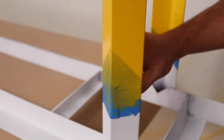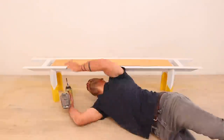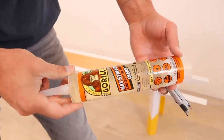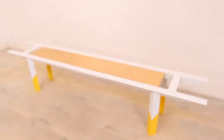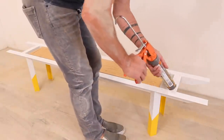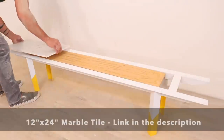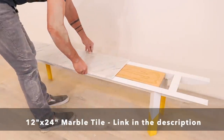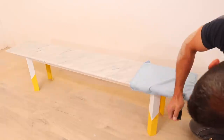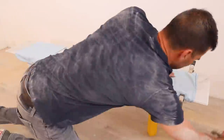Removing the tape and revealing those nice crisp paint lines is one of the most fun parts. I then placed the piece of MDF and used short three-quarter-inch screws to secure it to the steel bench. I'm going to glue down the tile, but I don't want the glue to squeeze through and show on the edges, so I'm using Gorilla Clear Construction Adhesive and spreading it to make sure it's not too thick. I'm using 12-inch by 24-inch marble tiles from Home Depot. I then placed some rags and used squeezy clamps to really press the marble down flat to the steel while the glue cures.